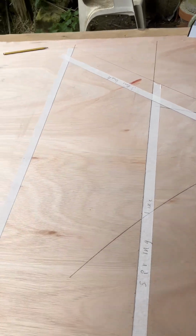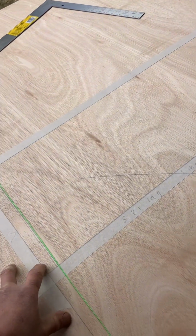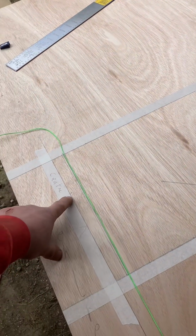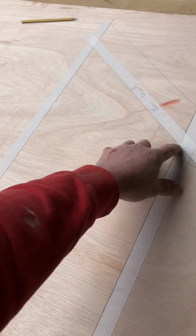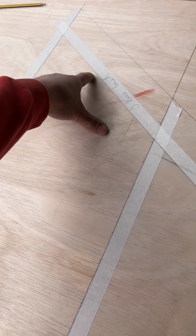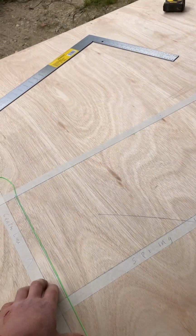Now, when you're setting out this cambered arch, you've obviously got a key brick, which needs to start with a full voussoir. Now, you also have to have a full voussoir at your skew back point. So therefore, you need an even number of voussoirs up to your key brick.